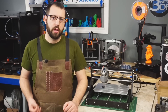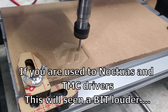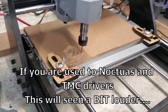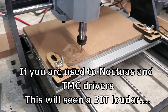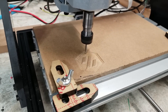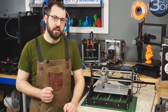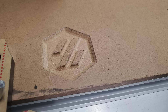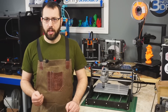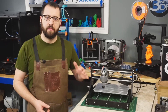The last thing I machined was the Voron logo in some MDF using a 3mm ball end mill. This toolpath was generated by a friend who also has this machine. I'm not quite well-versed enough with Fusion 360 CAM software yet, but this was machined using the 3D Adaptive toolpathing in Fusion 360, and the end results came out quite clean, especially in the MDF. It cuts cleanly — there wasn't any burning or gumming up of the tool head.